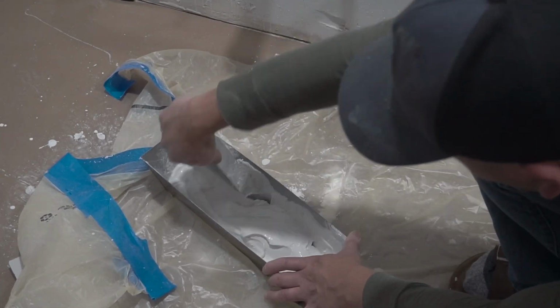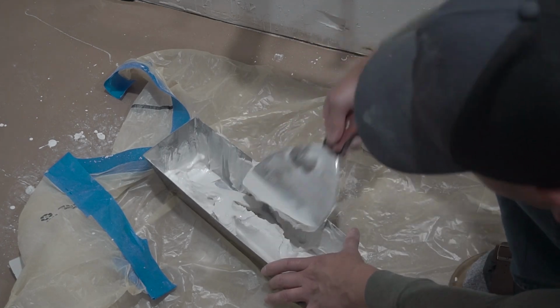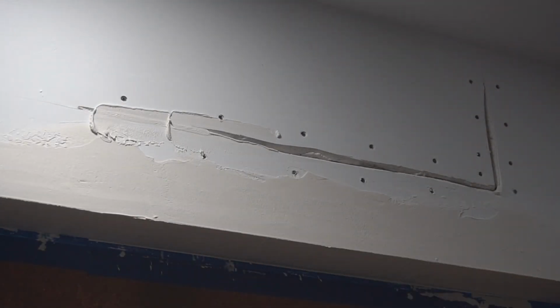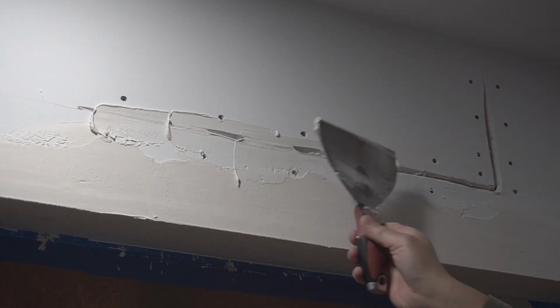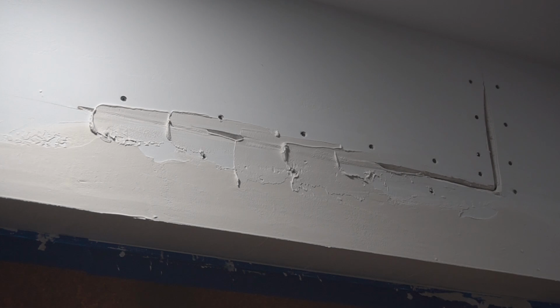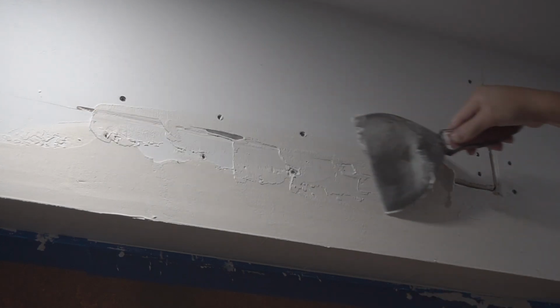We're gonna fill in these cracks first with the joint compound. Now if you're gonna be using mesh tape to seal these in, use the mesh tape first before applying this. For me, I like to use the paper tape a lot better because it's easier to work with, in my honest opinion. Again, you can use either mesh or paper. I'll leave those in the description down below as well.